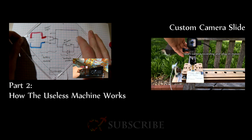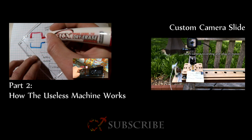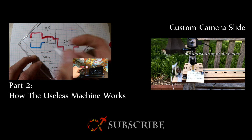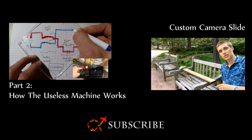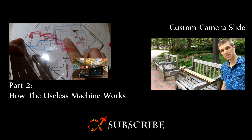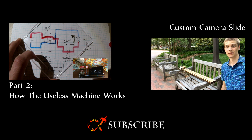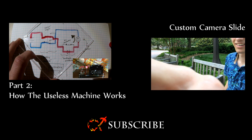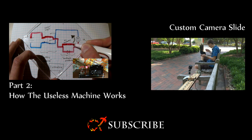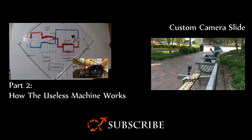That has the net result of reversing the battery that is applied to the rest of the circuit, which means that current can flow through the motor and now through that diode that used to be reverse-biased. The motor is actually running at this point and the arm is extending towards the switch. Even once the arm pulls away from the normally closed momentary switch that's inside its housing, the arm continues to move forward. This is where you've got the 4 input states and 3 output states — somewhere one of the output states needs to be doubled.